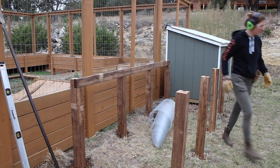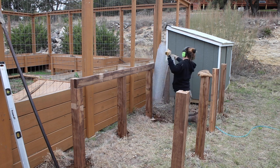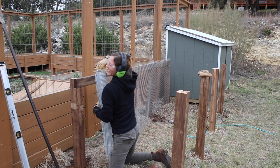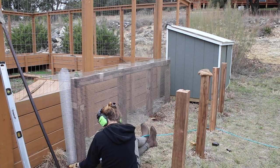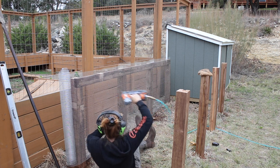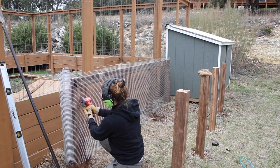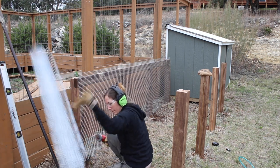The next step is to dress off the back. There are a few options for screening but I recommend hardware cloth. It's a bit of a bear to wrestle with while it's on the roll, but once you get into a system it's easy enough to install. I'm using a crown stapler to pin it into place, working out any bubbles as I go. I first pin it in just a few places to hold it down, then once I don't have to hold it I go back and thoroughly attach it. To cut hardware cloth you can use side cutters, but a faster way is a right-angle grinder with a cutoff wheel.